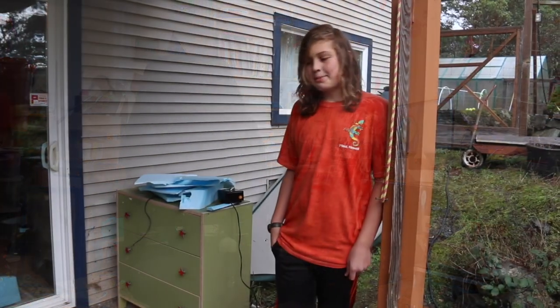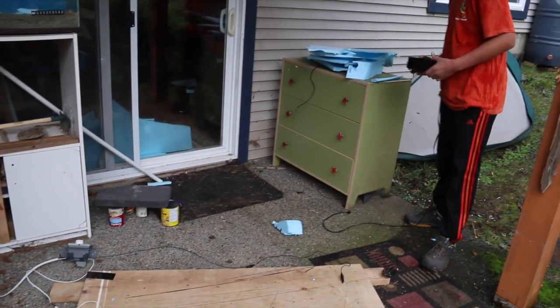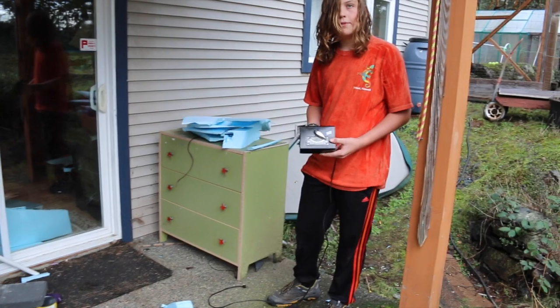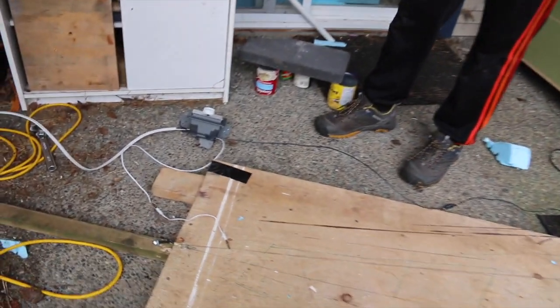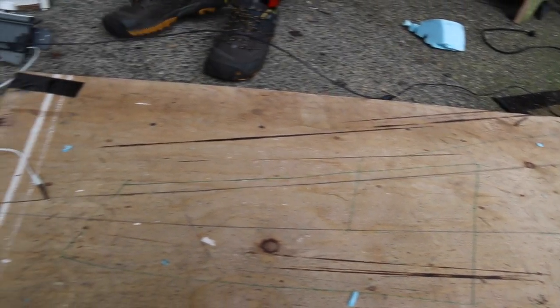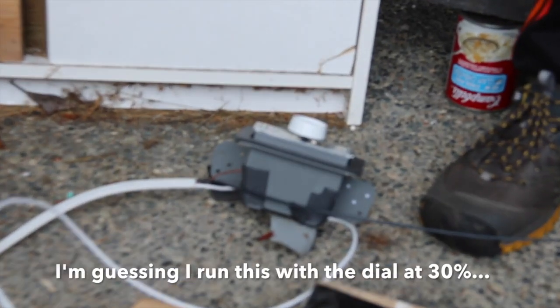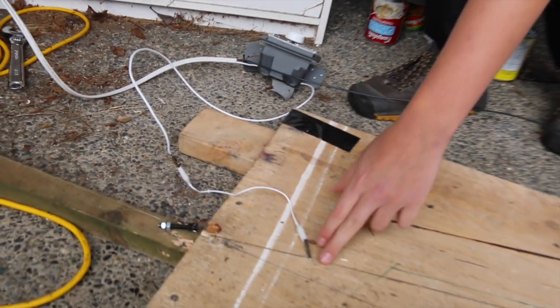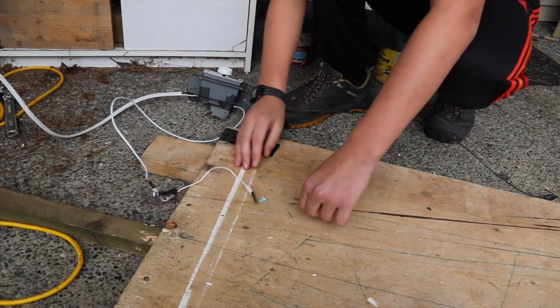I'll go outside and show you my foam cutter. This is my flat foam cutter. To power it originally I was using a guitar string and then an old train controller that went from 5 to 15 volts. Now I'm using a dimmer switch with alligator clips to the cutting surface right here, which is basically all cutting surface — so that's the maximum wing size you can do. The dimmer switch goes from 0 to 120 volts and you can go anywhere between that. Alligator clips take the current from the dimmer to the wire on each side. The fishing line you see here is to allow me to cut a better angle of wing.